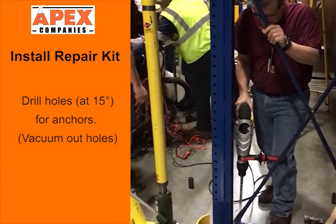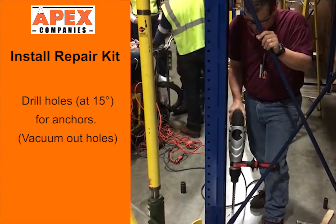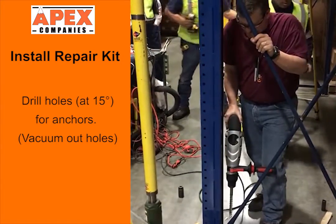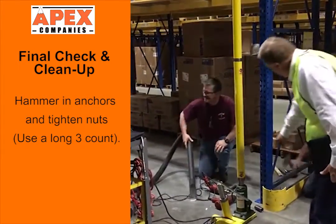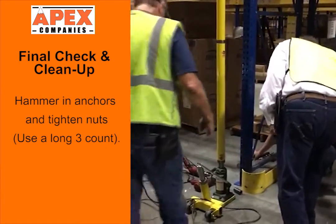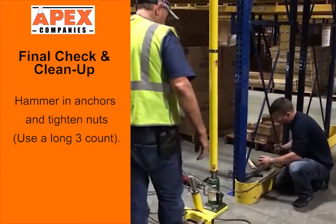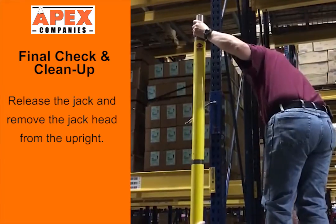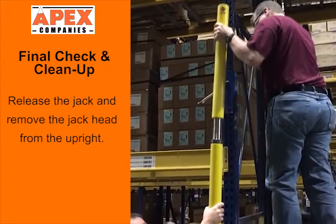Now drill holes at 15 degrees for anchors and vacuum out the holes. Hammer in anchors and tighten the nuts, using a long 3 count. Release the jack and remove the jack head from the upright.